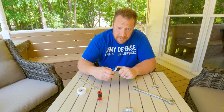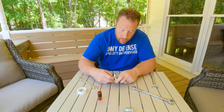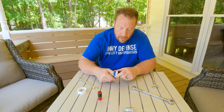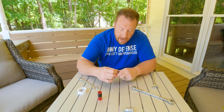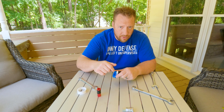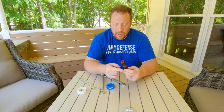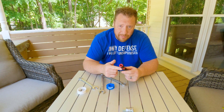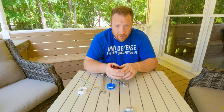Quick little tech tip — same as I showed you in the last video where I built the whole system: when you're putting your Teflon tape on, make sure that you're advancing it around in the same direction that you will tighten, so that when you break off the tail, the tail will fold in as you screw this on and it won't try to unravel itself. When you're tightening those on there, you want to get it nice and tight — but these are aluminum fittings so you don't have to kill it and break everything in half.